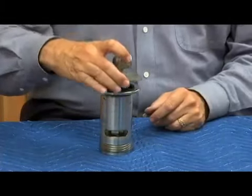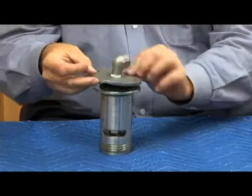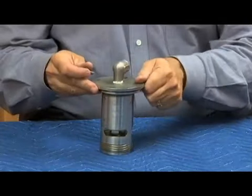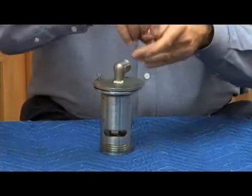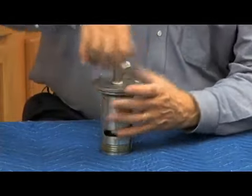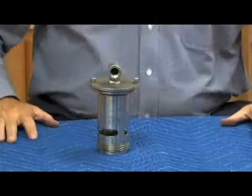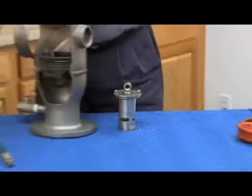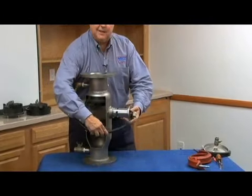Now, taking the relief valve cover back on, you'll notice that there are four bolts spaced all the way around it, so equally spaced. So if I go ahead and tighten these four bolts on now, this street L could be pushing off in any direction. In other words, I tighten it here, it moves all the way around. It's important that when we go to put this back into the body, that street L end is in the location of where my sensing line was.